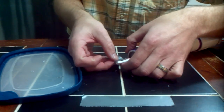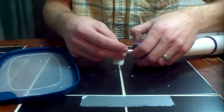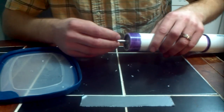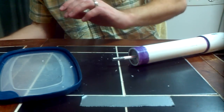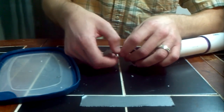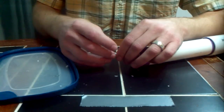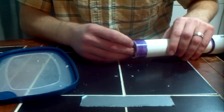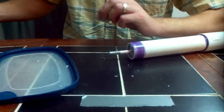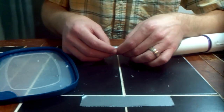What I do is just wrap it around — that's going to make the top of your straw progressively wider the more tape you put on it. It doesn't clog the nozzle. I've never had a problem doing this — you don't have to worry about having too much material in there. Just put a strip on and check it; if it becomes snug, then great, if not, put a little more. It's better to have to peel some away than to have your igniter drop down into the motor. This duct tape will burn away without a trace. This igniter burns just like the Bates grain at 1,000 degrees, so it will be gone.